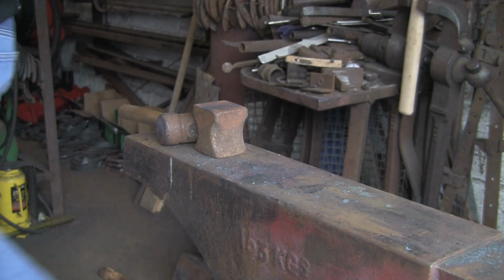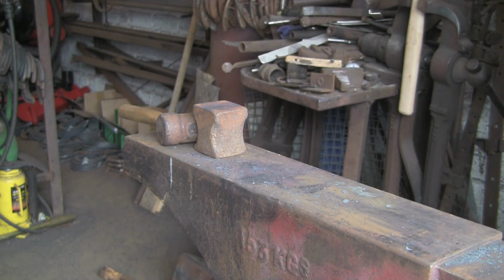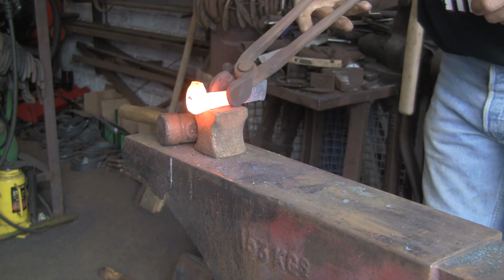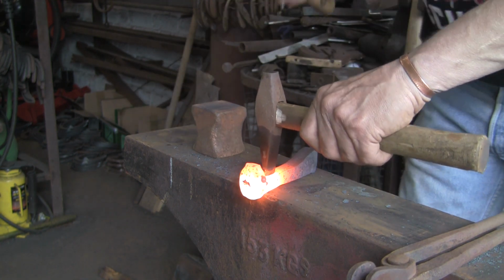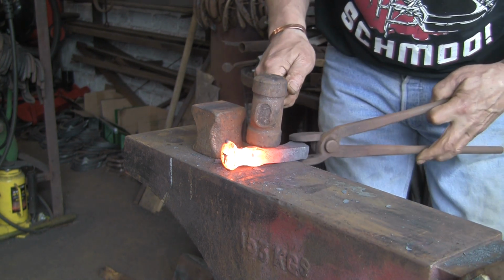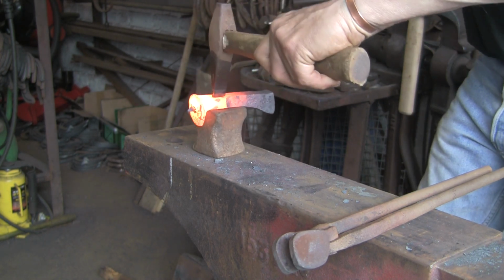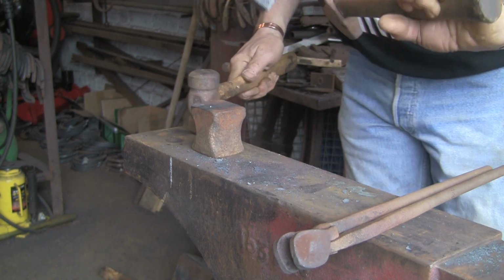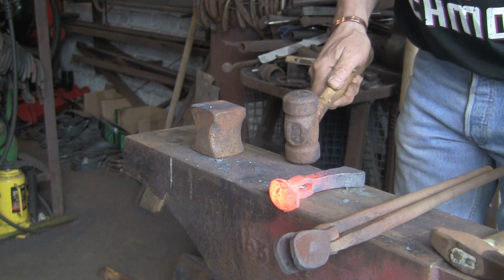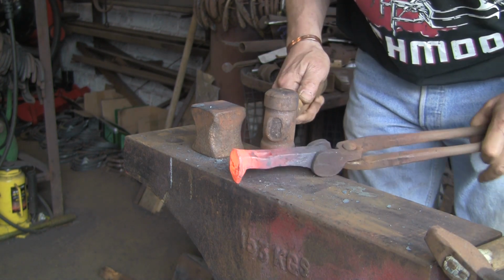It's just that the tools I buy, because I don't make my own Hardy tools, you just buy them. They usually have a smaller Hardy shank, the actual bit that goes in the hole. But as I say, you don't really want them tight. Sometimes it could be handy to have them tighter than they are, but you don't want a tight hole. Not in this game. That's through, you can see there. And the slug hasn't quite come out, it's still in there.